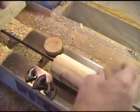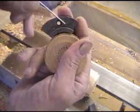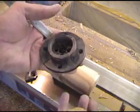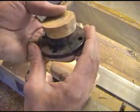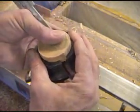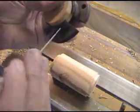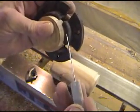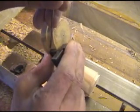And as you can see, if we go from the smaller tenon up to the larger tenon, that gap gets bigger and bigger. So when we think of the four-jaw chuck being closed, our tenon should be sized more like here, that is close to the size of the four-jaw chuck, so that when we're out here we don't have a lot of gap in between each jaw, and that will give us the closer fit, not having this little gap in the side. When we make a tenon, we need the jaw to fit on this face.